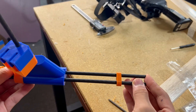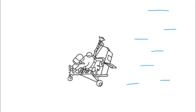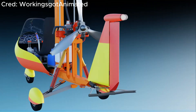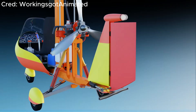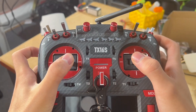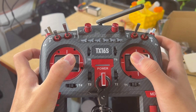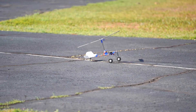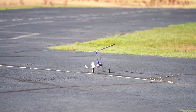One important aspect with most gyrocopters is that since lift is generated by freely spinning blades, rolling will often cause the gyrocopter to drop very suddenly. That's why most of the turning authority comes from the rudder instead. In some cases, you'll often need to roll in the opposite direction of a turn just to keep the rotor flat and level — especially with RC models, because their lightweight blades hold less spinning inertia.